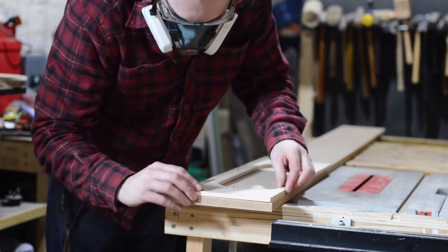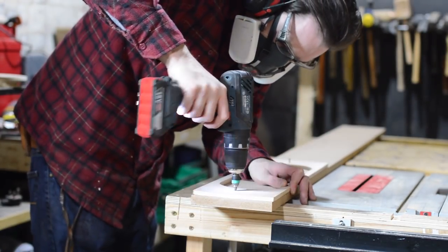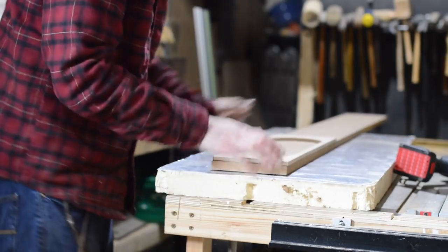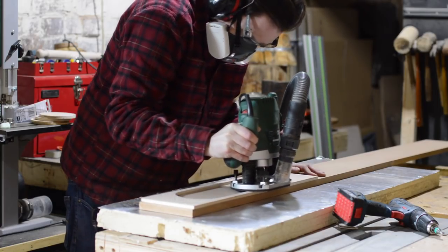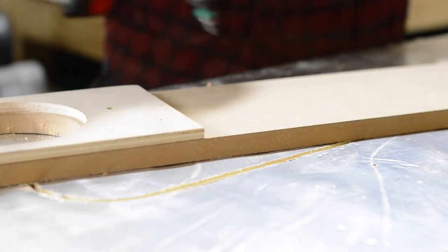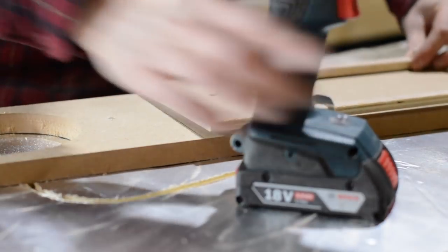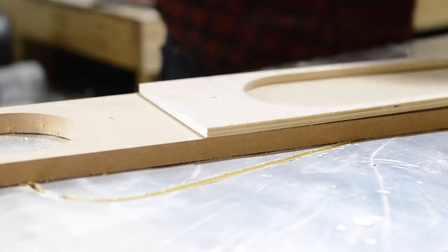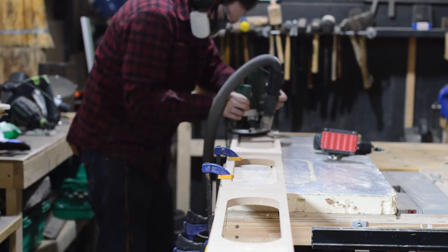After all four of the smaller pieces are done I can work on the two longer sides. This time instead of having the template hang over the thickness of the MDF it butts up flush to the end. For the smaller pieces I had them held in my vise, but the longer pieces won't fit so I'm just using a bit of insulation board to go underneath. I then cut the pieces out the same way, but before I remove the template I draw a line to indicate where the first one was, then I can unscrew it and butt it up to the line, moving it along. After the three holes have been cut out along both sides, that's all the bits done.